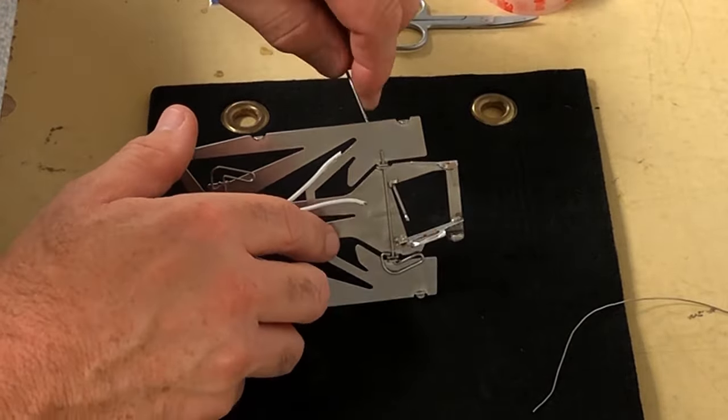Much better. Next, we're going to take the ESC, which is right here, and we have to insulate it. You can see that there's contacts on the bottom right here that obviously can't come in contact with the steel frame. So I prefer the clear 3M double-sided tape. Works really well. And what I do is stick it directly on the bottom of the ESC,